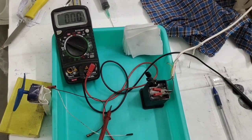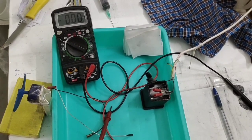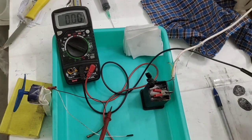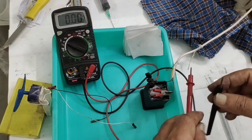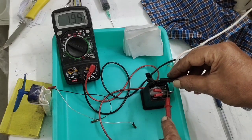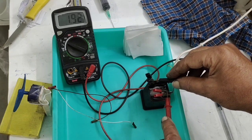Those steps I will follow, and finally I will check the voltage generated. The formation step is ongoing — only 5 minutes have passed. I will now switch off the external DC current and check the voltage. You can see on the multimeter: 1.94 volts. Within just 5 minutes we are able to see a voltage.